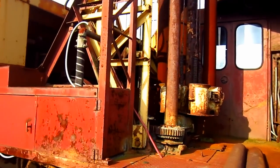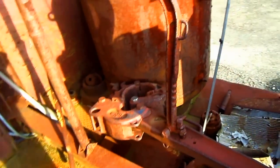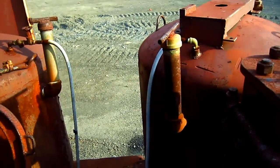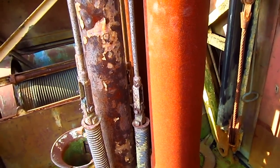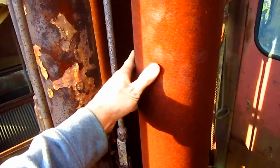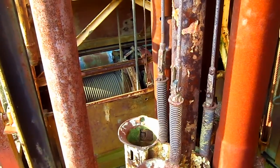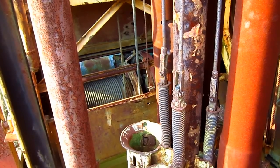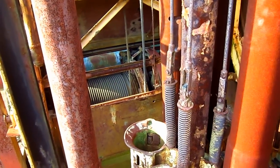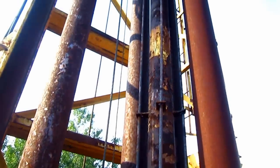Now let's go up on the 40R. On the front of the drill, you can see the two big propane tanks for the cab heater. The 40R was designed for drilling holes ranging anywhere from 6 and 3/4 to 9 inches in diameter, and here you can see one of the big steels. Just like its larger brother the 50R, the 40R featured a rack and pinion hoist and pull down system, which applied an increase in thrust load to the bit. This design feature was adopted from the company's cable shovels. Here you can see the cable reel for the maintenance hook, and from here you can get a good view looking up at the mast.